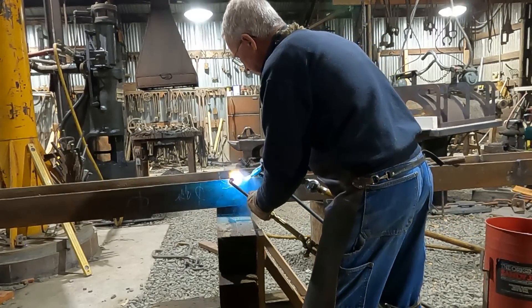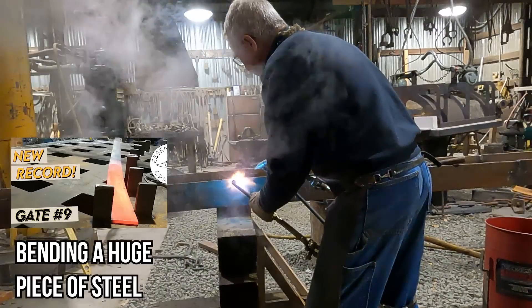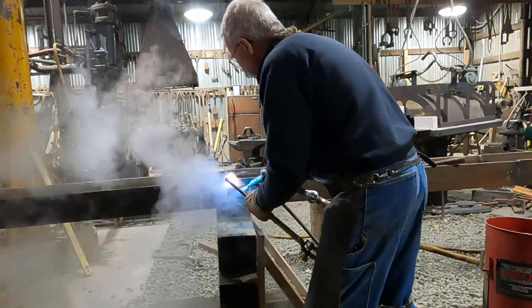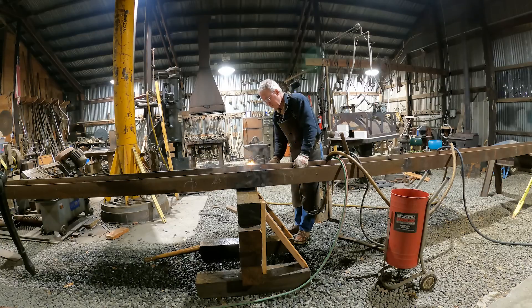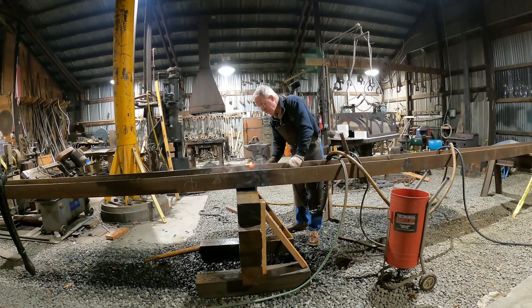John Adolph and Bob Bergman both told me that if I can get gravity to help with the shrinking I'm trying to make happen, the progress is much faster — and they just weren't kidding. The weight of this beam in this position is a big help. Now the fundamental concept of shrinking steel, as I understand it, is that when steel gets real hot — maybe over critical temperature in one spot — when it cools, it's smaller than it was before in that spot. This is just a fact of creation that plagues fabricators all the time and occasionally gets them out of a jam.